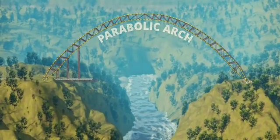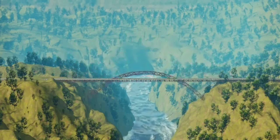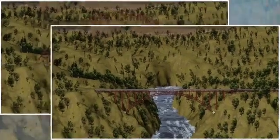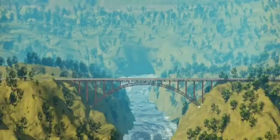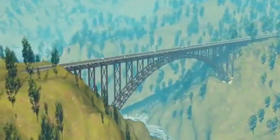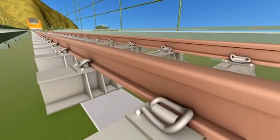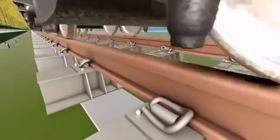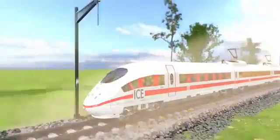Now, let's construct a road deck below this arch. One way results in an unnecessarily huge arch bridge. There is one more way to achieve the same objective — just shift the supporting arch down. The force induced in the arch remains the same. The above-deck design is preferred because you save a significant amount on construction materials. The Chenab Bridge uses a ballastless track, as almost all high-speed railway projects do. These components absorb vibrations, and the bridge is designed to support trains at a maximum speed of up to 100 km/h. Ballast tracks have issues of dust pollution and low life expectancy.